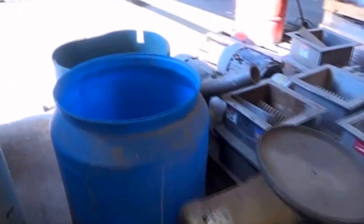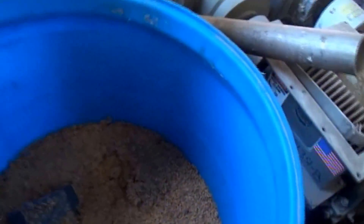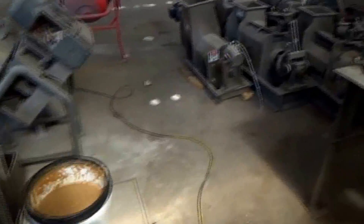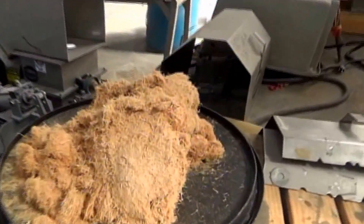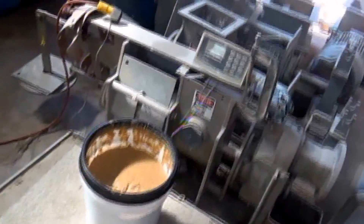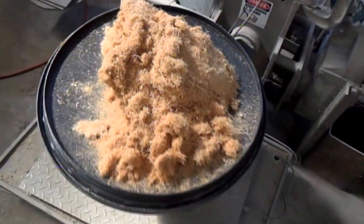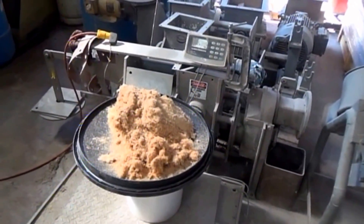This is going to be a lesson in press aids. Here is cottonseed hulls — that's a press aid I could have used. Over here I found a drum of rice hulls; that's another one commercial apple juice producers like. The one we're going to use is the wood fiber, which you saw earlier. I've gotten together a net weight of a pound of this stuff. I've got my pelletized sample and I'm going to put 3% by weight — I weighed the sample, tared out the cover, and now that combined gives me a 3% press aid.